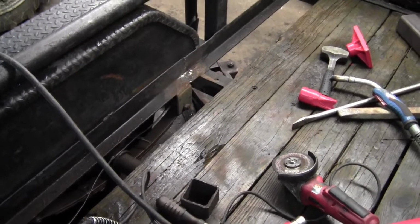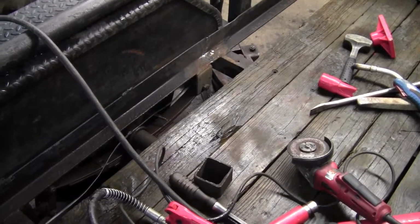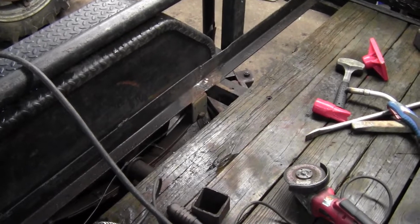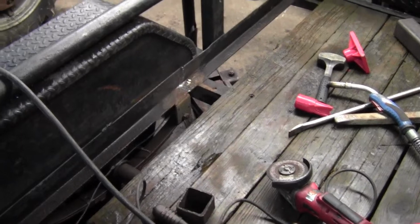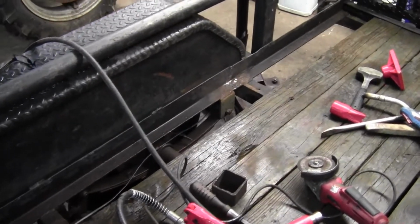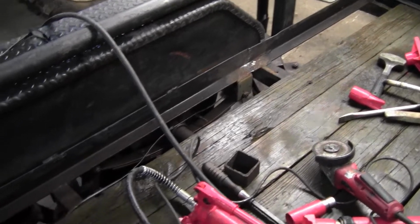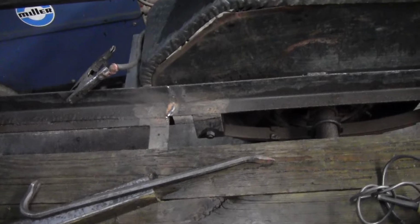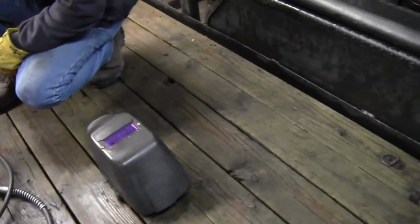We're going to drill also through the angle. Right. Put some rosette welds or plug welds in and tie it in. Because if we just weld in the ends of the scabs, obviously it's going to keep the stress in the middle. Right. Not do much, so we've got to rosette it in. Probably 3 places on each side, maybe. Yeah. On top and bottom of the flange.